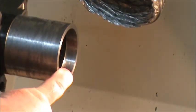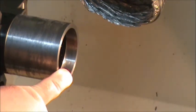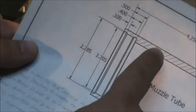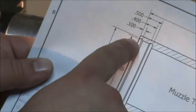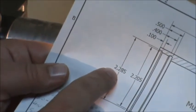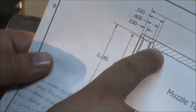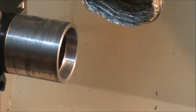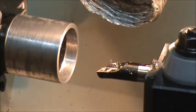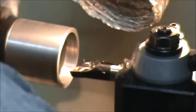I've got my 2.205 — that's my maximum minor diameter for my Class 3, 2.25 by 24 threads-per-inch diameter, which is my actual thread diameter. The rest of this part is my 2.205 diameter. I'm going to have a small clearance in here for a little alignment boss, and then I have my thread relief to cut in the back. That boss is 2.285 for a distance of 100 thousandths, so I need to open it up to 2.285 and go 100 thousandths deep. I'm actually still at 2.105, so I have another 100 thousandths to go.